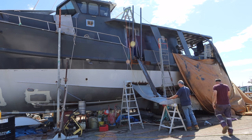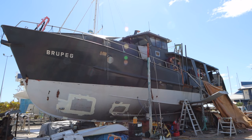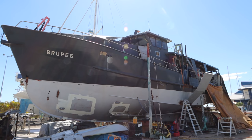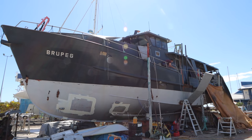Ignore the frame up on the roof, that's not being used anymore. We're going to be lifting from the door like we did on the first wing. What we need to do is align the second slider on this side. We've got the rear slider organized and we now need to do the front slider. So to do that, we have to lift the wing up and down so that we can measure how far out we are in terms of our measurements with the alignment. But that allows us to then start moving onto the pulleys.